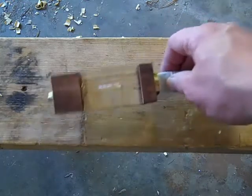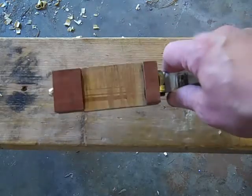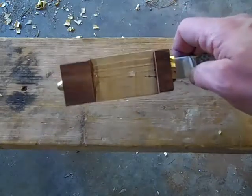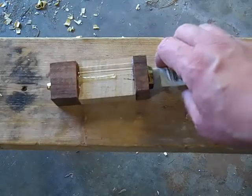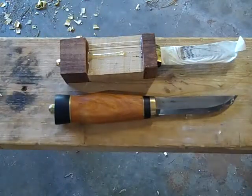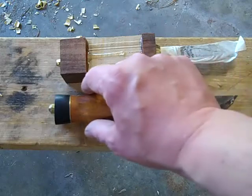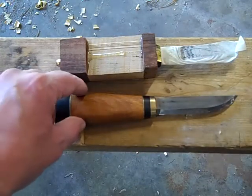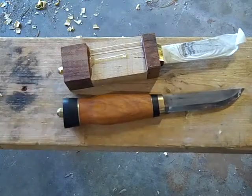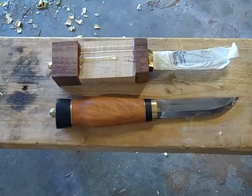At this point, this knife is darn near finished. Beyond this, it's just a matter of aesthetics — how do you want the handle to look, how do you want it to fit in your hand? That's just a matter of sanding, shaping, and finishing the handle. I'm going to make the handle similar to this earlier Pucco I made: narrow taper down to the blade, palm swell, and then a flare at the end. Basically, that is the process I used for making a stick-tang knife — in this case, a Pucco-style knife. Thanks for watching.